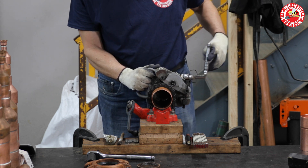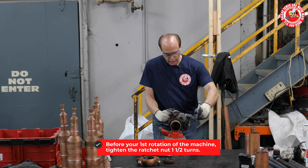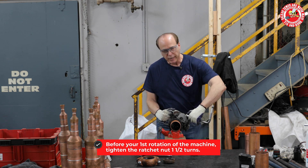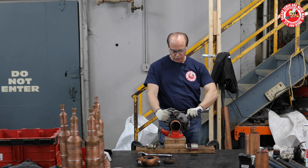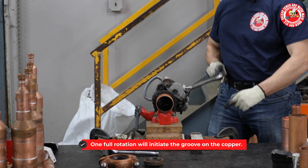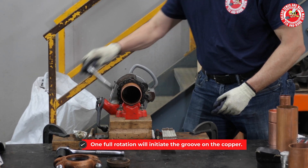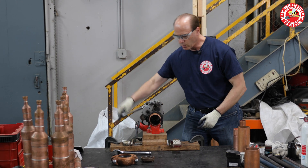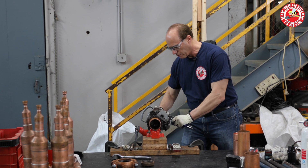I'm going to put this vise in. For the first rotation, I have to tighten this one and a half turns — that's a half, that's one, that's a turn, that's one and a half. Then on the back, the same ratchet will fit into the rear of the Ridgid. I will do one full rotation all the way around. That will start the groove in this copper tubing. You can feel when you make one full rotation because it will sort of loosen up — you know that you've fulfilled the rotation when it loosens up.